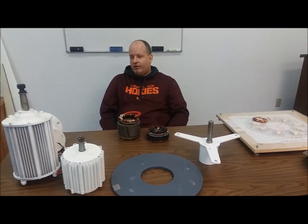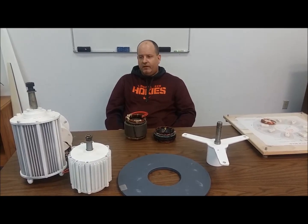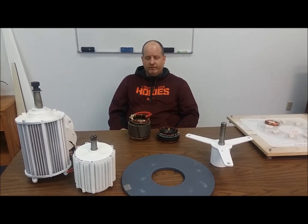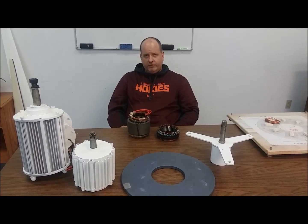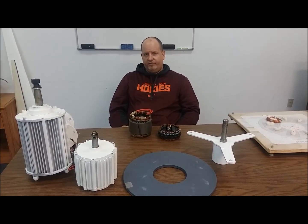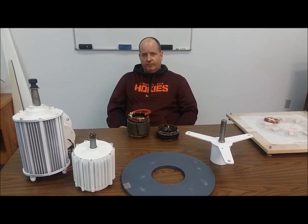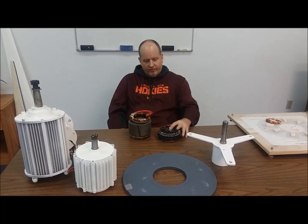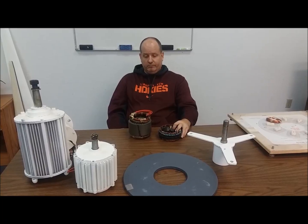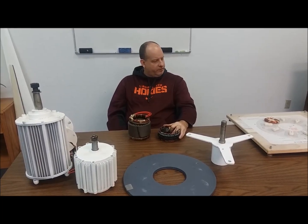We got some comments, and somebody made a video talking about liking the smaller blade set. You have to understand that if we took our 450-watt light set and put it on the 2kW alternator, it probably would not turn it. Your blade set has to be matched with the alternator. That's also true of the bearing sets — if you have a small bearing and you put a giant blade set on a small PMA, something that weighs 10 or 12 pounds, that's going to be a disaster.